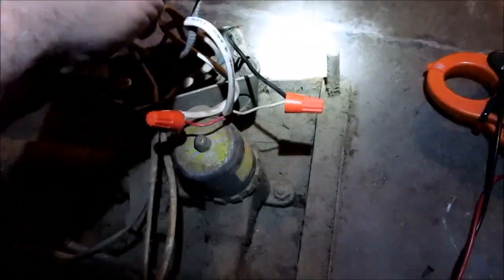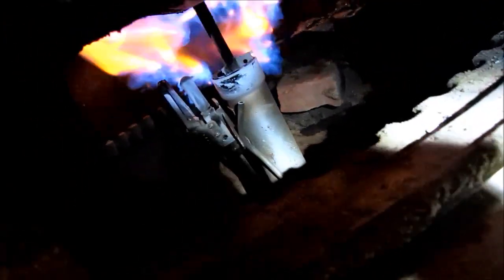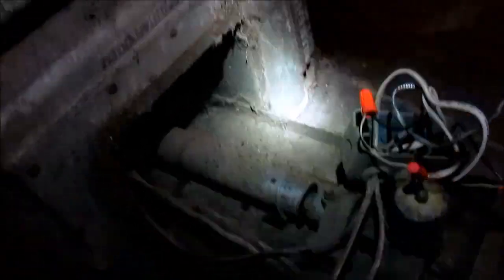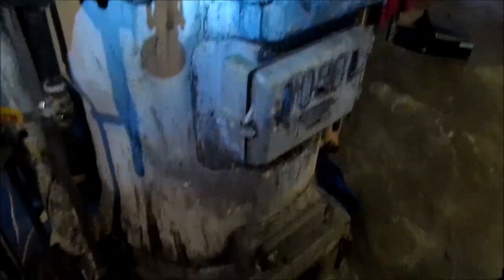This is a bi-metal switch. I've got a pilot there — you can see it in there to the left. The bi-metal switch wasn't making it, so I've got it jumped out right now. And as you can see, there's my big old flame — it fogged up my lens. The secondary air was all plugged up with who knows what. Let me get the analyzer on it and see how this thing's running. The flame's looking a little iffy.